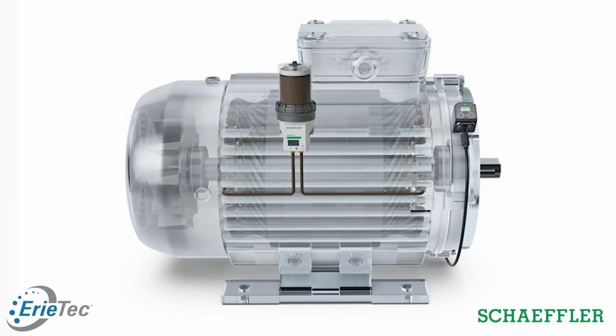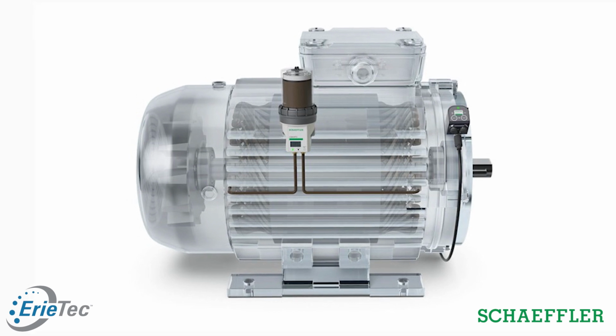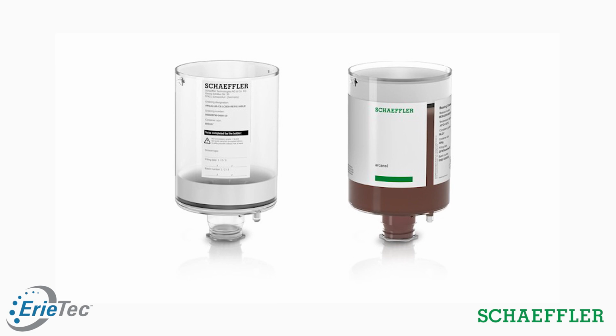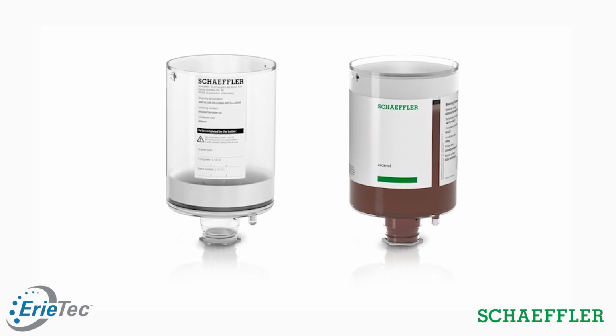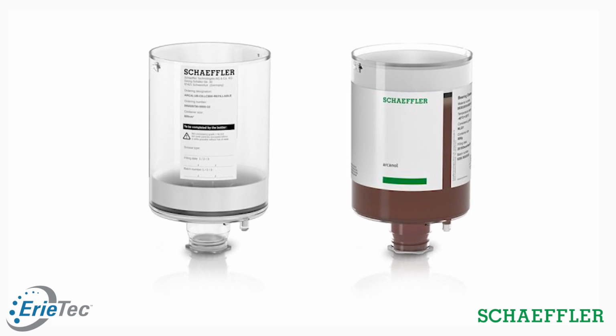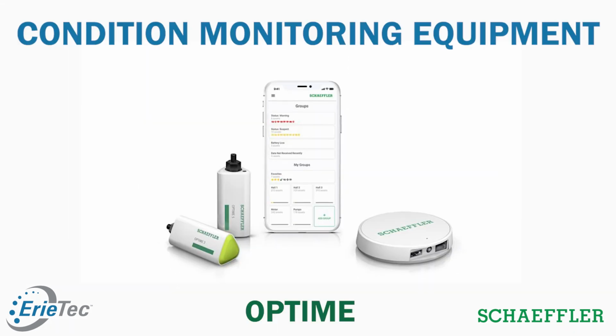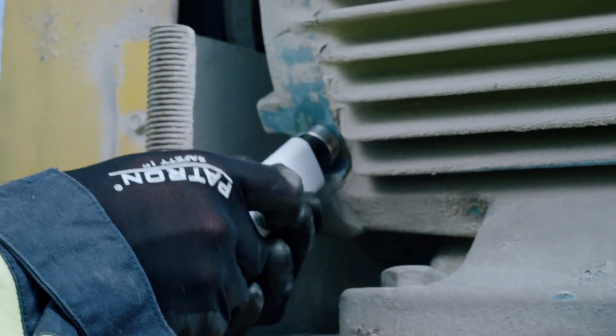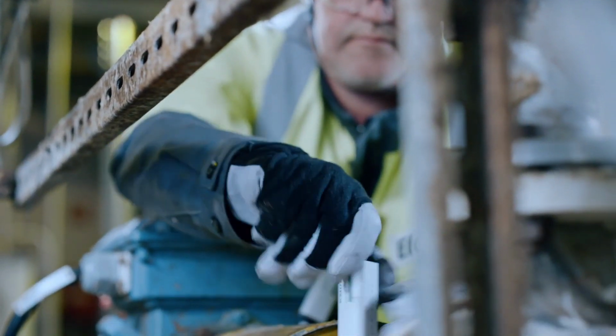At this point, the bearing should be closed up and we should be ready to put on any auxiliary equipment. For example, you could be putting on an auto lubricator to monitor how much grease is getting to this equipment. It's going to dispense a specific amount of grease at a specific interval that matches the OEM relubrication recommendations, and this just eliminates any human error in the re-greasing process. You could also be installing condition monitoring equipment such as the Schaeffler OPTIME. With this, we track heat and vibration to make sure the bearing's running as we anticipated. Finally, we want to reinstall any machine guards and clean up our work site.